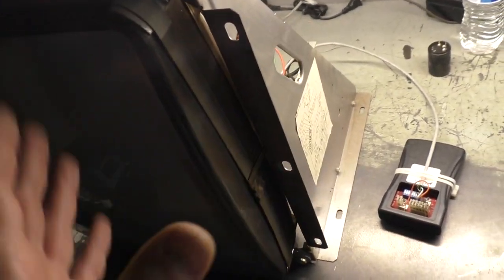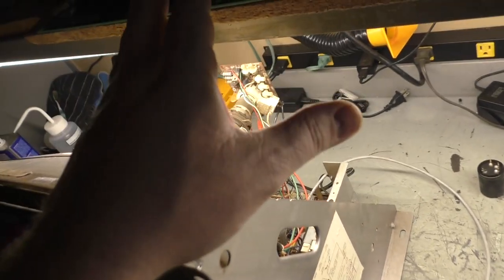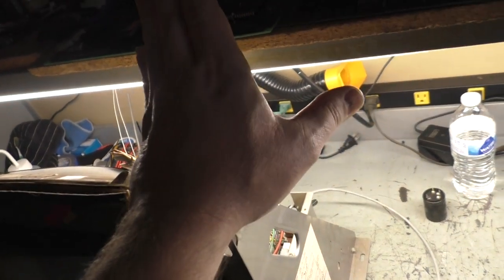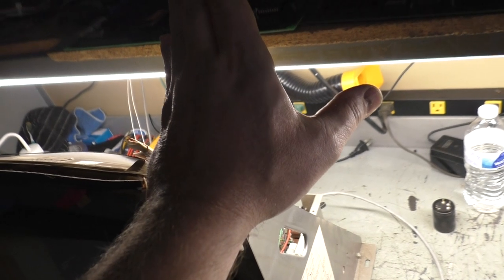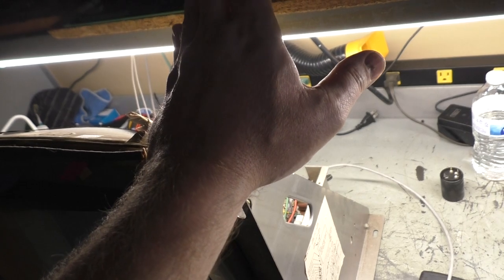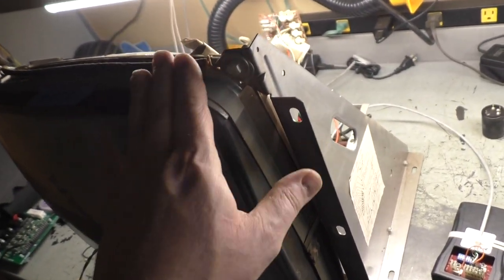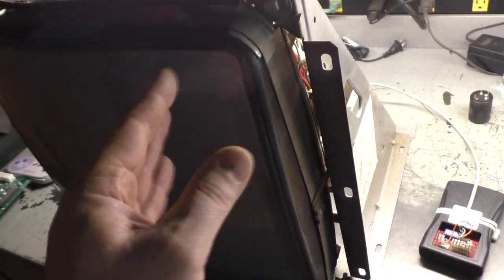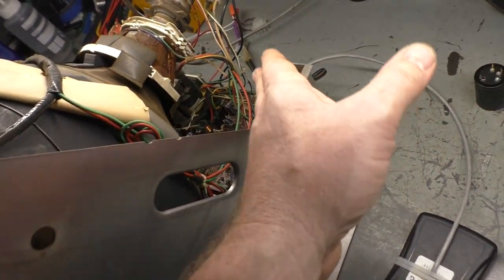The Mortal Kombat board that I normally use for testing on these systems and setups, the reason it's a test board is because it doesn't like to play nice with some monitors. Like, it'll sync with the 7000 and it'll sync with, I believe, the K4600 and the G07, but something like the K7400, the U2000, and the K4900, it doesn't quite like those sync signals and it goes haywire. So it turns out that our haywire image is not a problem of the monitor or the chassis or anything, it's a problem with the board.